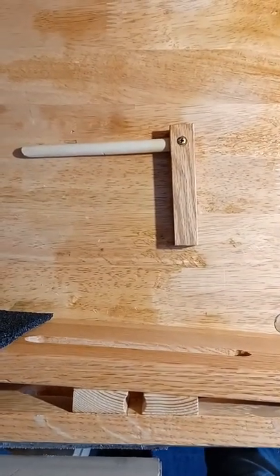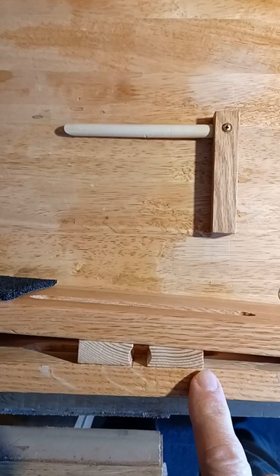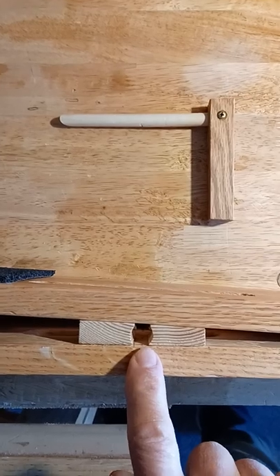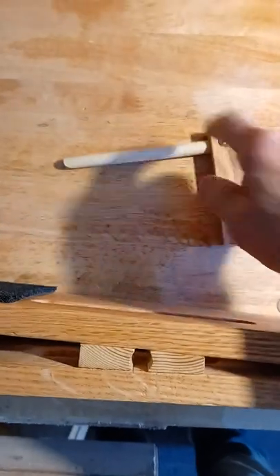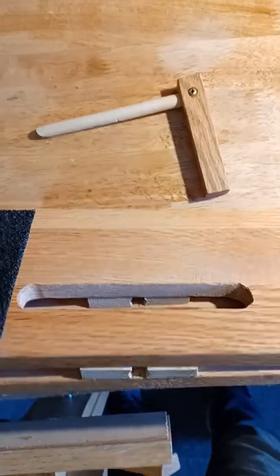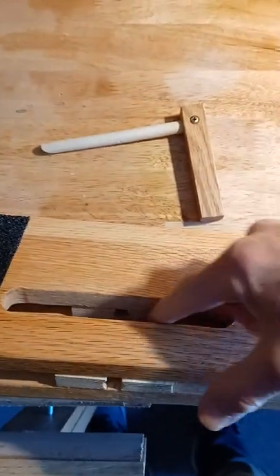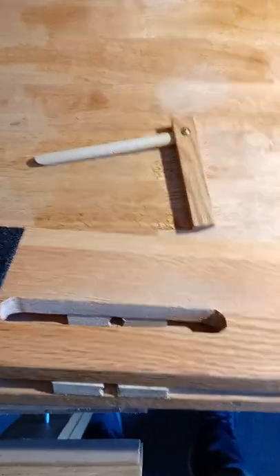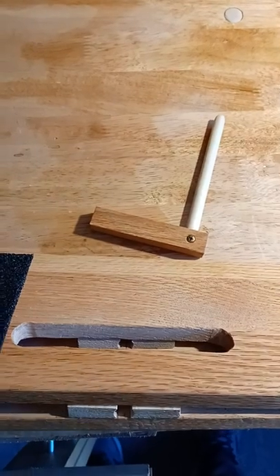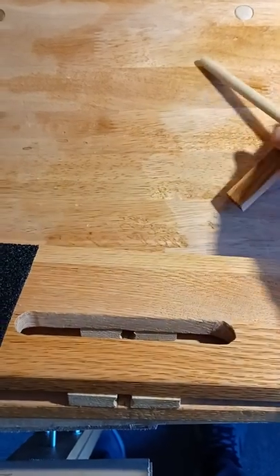Here's a look at the axle and the bearing. The bearing is just two pieces of pine that I've cut and angled so that they hold up the ramp. With a gouge I've made the inside the shape of this axle, and I've done that for four pieces of pine — one in front, one in back. The front one matches the diameter of the axle, but the back one is snugged just a little bit closer, slightly smaller than the axle. And then the end of the axle I've planed just a little bit so it's an oval — that is the secret to the quick release system. The end of the axle also has an angle on it so it'll slip in more easily.